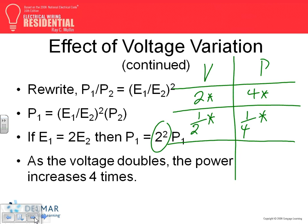Say the distribution system here was 4160 volt. We have a city of Bloomington with a transmission line at 4160 volt. We decided to up it to 13.8, so more than double. So the amount of power, the amount of homes that we can feed, is now 4 times. In this case, it's actually much more because we're more than doubling. Every time you double the voltage, you can feed 4 times more things out of it.